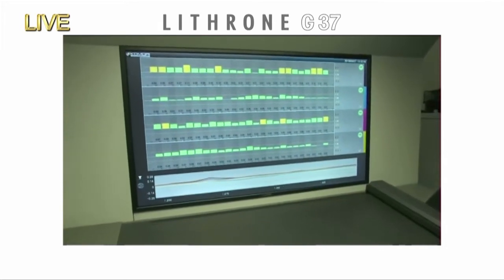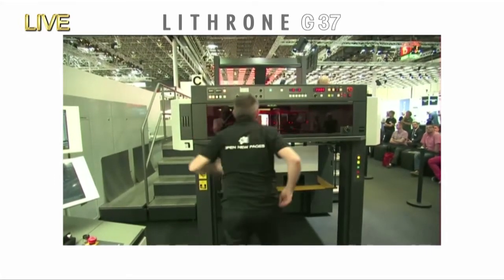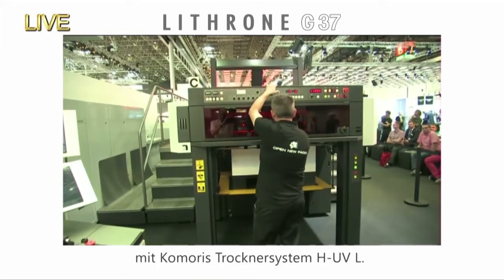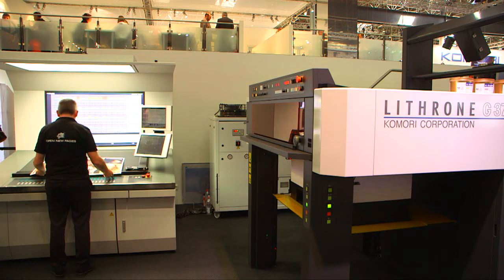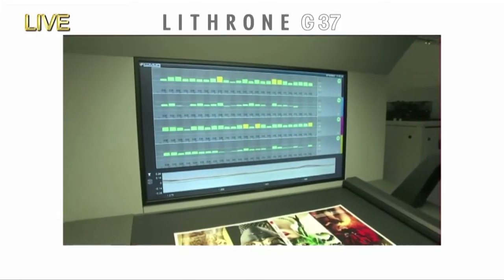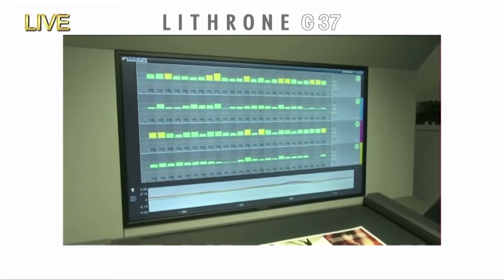The first job — the 8-page A4 work-and-turn printing — will now start printing the second side. This enables printing of both sides in a very short space of time because of the instant curing. The work-and-turn printing can be finished in just over three minutes because of that instant curing, which means it can go immediately to post-press. The prints include a color bar along the bottom — do take a look at the quality for yourself. High-productivity, short-run operation is possible, even with a one-sided press, when utilizing the HUV system.